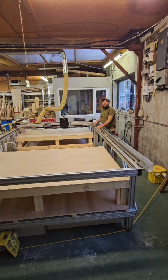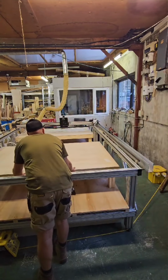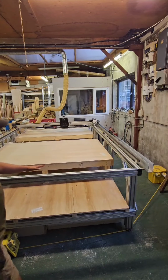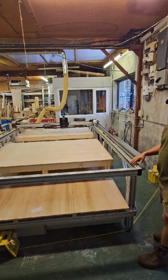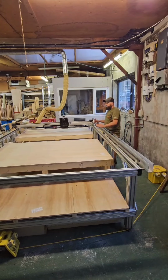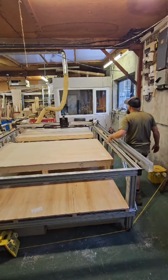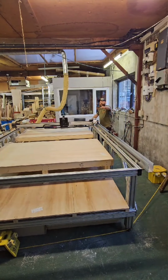So what I did in the previous videos is I upgraded the depth. Now everybody loves a bit of depth, a bit of girth, and my CNC needed a bit of girth. So now we've got a 500mm changeable base. And what I mean by that is I've got 500mm from the bottom. At any point I have a massive tree, I can change the depth of my bed. These are my two sliding beds, which are 100% accurate, 100% to 0.033 of a millimetre of level across the whole thing. The CNC now is completely solid, where before it used to be really shaky. It is now solid, which is what you want when you're doing accuracy, slab facing, sanding. That's going to be in the future, by the way.